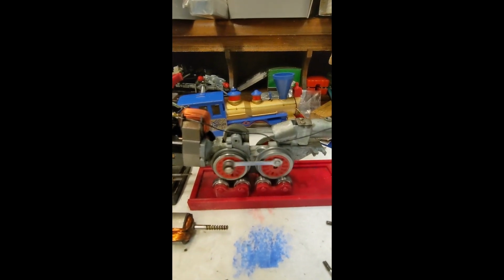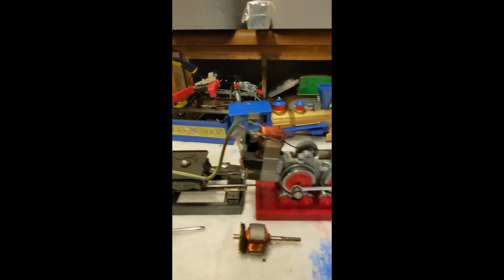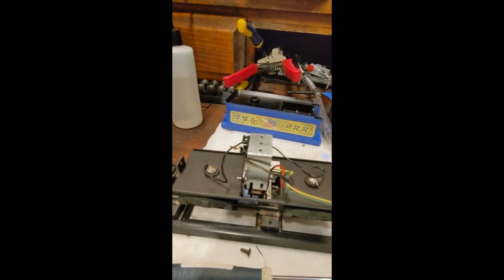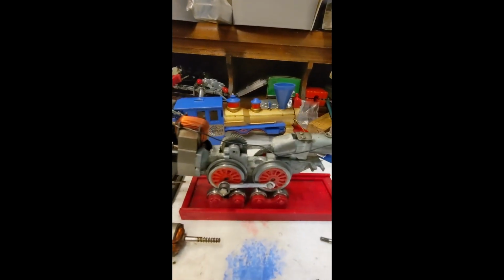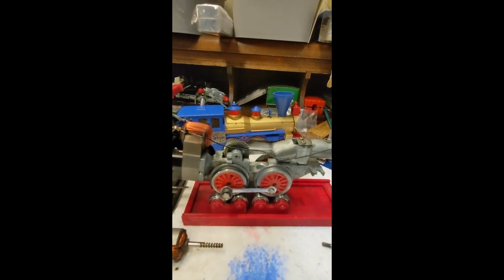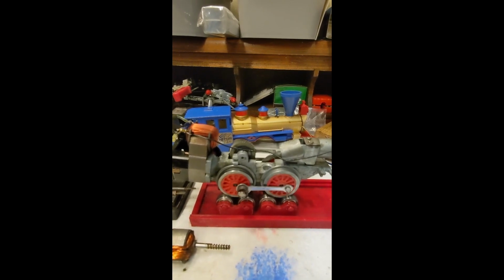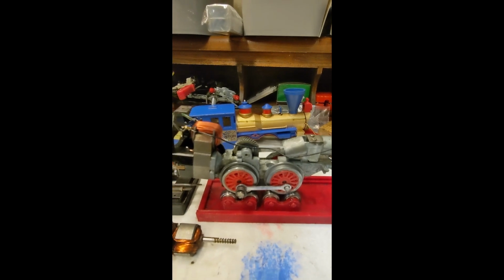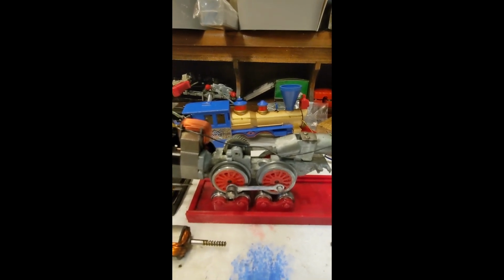But we are in good shape here. You see, we got great RPMs. No sound out of the solenoid here in the reverse unit. So that tells me we've got good use of our voltage, and we don't have a lot of overheating, that kind of stuff. Plus, as you can hear, if I stop talking, I mean, this engine is winding out, so it's running real free. That's what we want. All right, I'll bring you back when there's something else exciting to report.